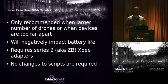In particular, if you say this device is a router, it's assumed that that device is on all the time. If it's an end device, you can let it go to sleep. And there are different sleep modes, and one of the more common ones that I'm going to implement here, I actually haven't quite configured these to do this yet, but I'll do this as soon as I get home. After some inactivity, it'll go to sleep for 16 seconds by default. And every 16 seconds, it wakes up for a tenth of a second, says, is anyone trying to wake me up? No, goes back to sleep. Right? You can't do that if you said, I'm a router. If you're a router, it's expected that you're always available.